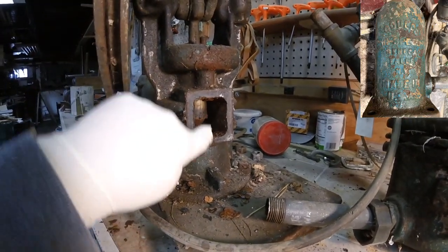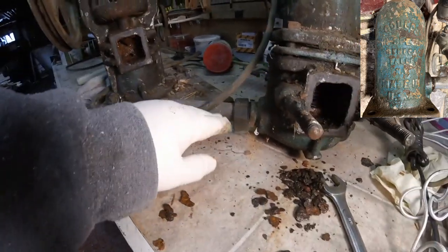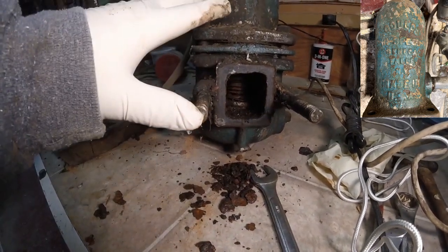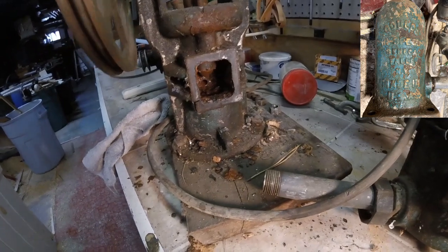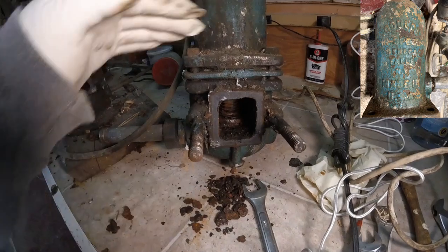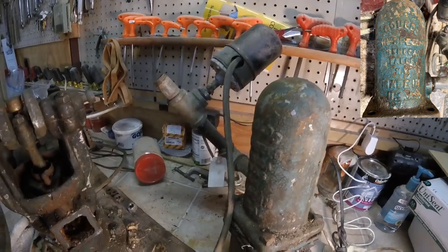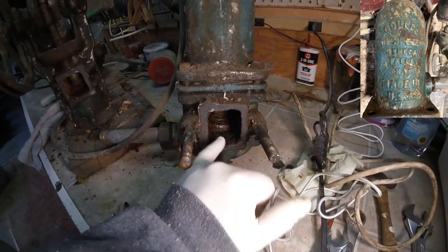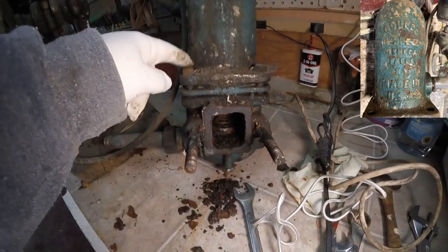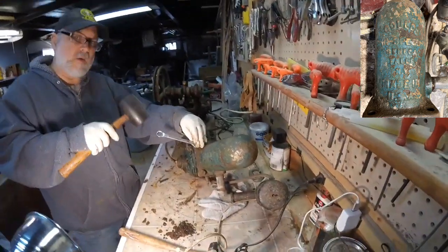You can see this comes down in. Alright, so when this piston goes up, it creates a suction through here, opens up this valve in here, pulls the water in, and then when this comes down like this, that's going to put pressure on this, close that valve, and then push the water out and through to the garden hose. So the issue must be at this point is that is worn out in there, which I think the next step is going to take this off the top here. If I can get it to at least start going.